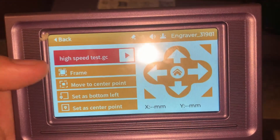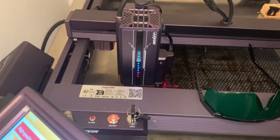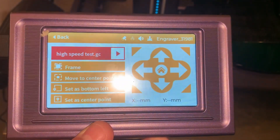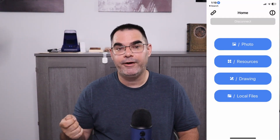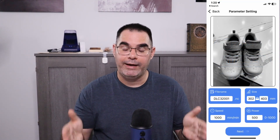There's an offline controller, which is great for a prosumer laser like this — you're going to want to run the same file multiple times without dragging a computer into the room. It has a 4.3-inch touchscreen to control it, and a phone app over Wi-Fi so you can send files from your phone to the laser. I can go work on a file, put it on USB, go down, and start burning, then watch a TV show in the same room.